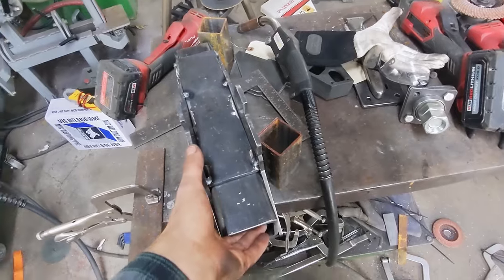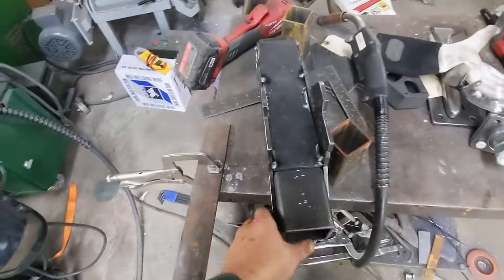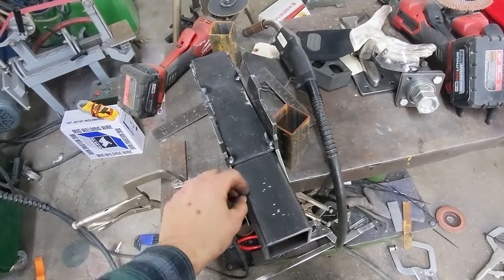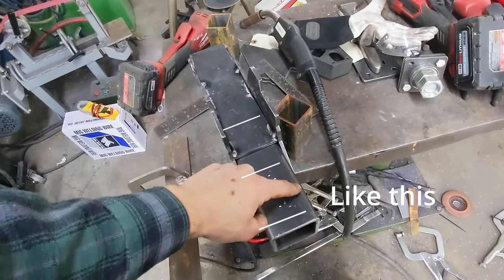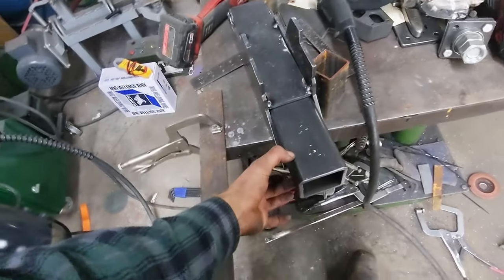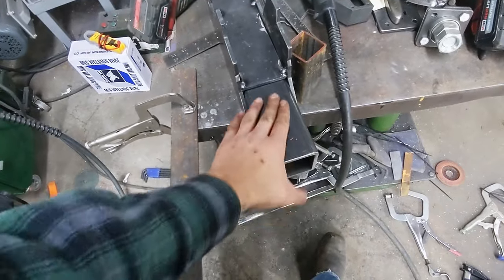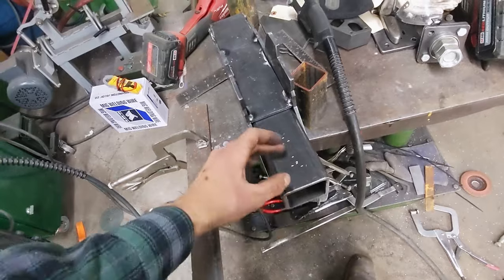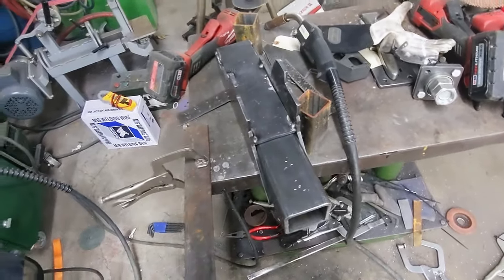I just tacked it up again with 35 thousandths wire instead of 20 thousandths wire, and that has a little more slop. So let's weld it up again and see if that does any better. When you tack it up, you want to have your wire out hanging over the radius because the edges of the tube are a little bit higher than the middle. The middle of the tube is not quite as accurate, and you want your wires as straight as possible so that when you hammer it out they kind of roll and it comes out a little bit easier — though you still have to beat it off.